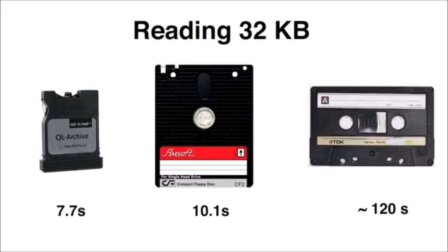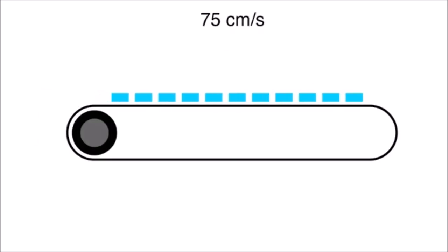So the results are in, and the micro drive is actually slightly faster than the floppy disk drive on the Amstrad CPC. Looking at the specs, it's listed as being able to transfer data up to 15 kilobytes per second, and we're only saving 32 kilobytes. So I suspect that the majority of what we're seeing is actually the time to seek to the right spot to start saving or reading the file, plus just a couple of seconds for the actual data transfer. That means that the longer the files you write, the more difference there would be with floppy disks.